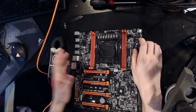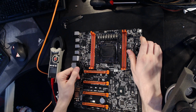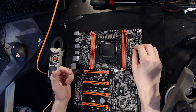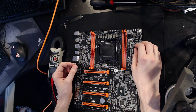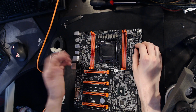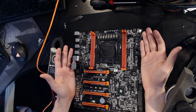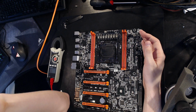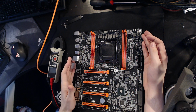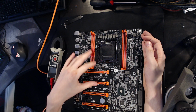Like on a lot of newer DDR4 boards, you will see single phase main memory power, and yeah, 2 560 microfarad polymers would totally not look out of place for main memory power. So Gigabyte's just gone insane here, because there's no way you can do more memory power than this. I mean, yeah, you could step it up all the way to an 8-phase, but at that point, you'd just be going, this is ridiculous overkill.